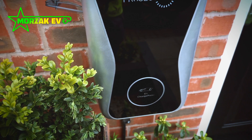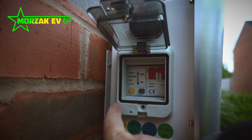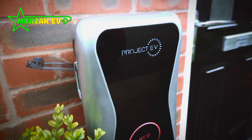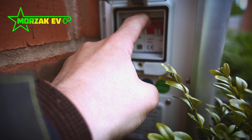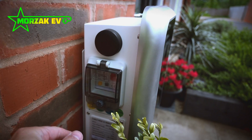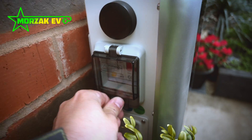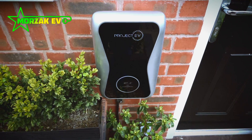I'll show you that again. You can simulate the RCD tripping by pressing the yellow T button — showing an error. So firstly, press the R button to reset the RCD, pull it down, back on. Then afterwards, make sure you shut and tighten the screw to make the unit waterproof again. And the error's cleared.